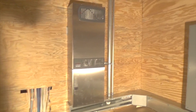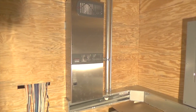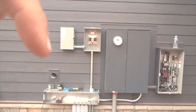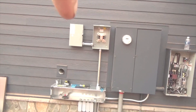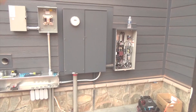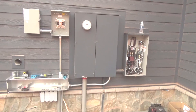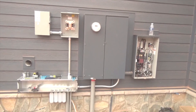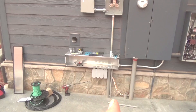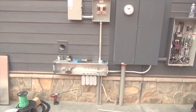We're dealing with the Briggs and Stratton generator — we have nothing to do with that — but we need to make sure we don't back-feed onto it. Outside, before buttoning everything up, we've got to put in a consumption meter — Duke Power requirement. Here's our shutoff disconnect for the SMA inverter. We've got a transfer switch for the generator on the right, and we need to pick up a 12-volt signal from there. When the generator kicks on, the output from the Radian will turn off. Solar wiring comes up the two-inch conduit, communications up the three-quarter, and we have LBs running everything down into the mech room.